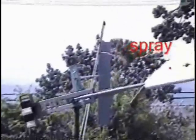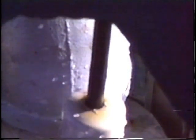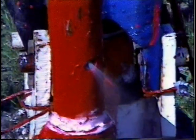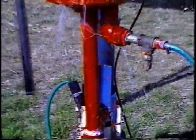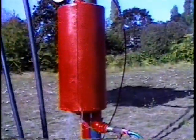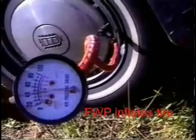The plunger rests below its normal stroke on a clean, wear-free static seal that can retain the water column for weeks between pumpings. Here the flutter well pumps the clean potable groundwater 20 feet high before draining it back to this low-yield test well. The vinyl-sheathed stainless pump wire slides through a standard bearing seal at the well head. This small compliance seal leaks less with less friction and expense than the multi-blade stuffing box and polished rigid pump rod. With a snifter, check valve, and tubeless surge tank above the well head, the pipe pump then adds one quarter air to its water stroke for smooth 40 psi streams of tire air and hose water from the tank top and bottom.